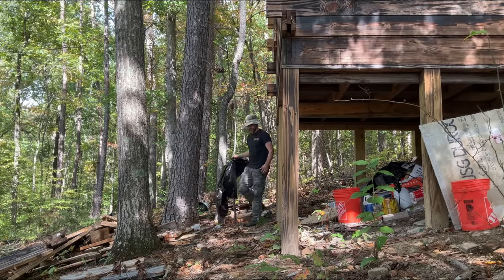One of the comments that I got quite a bit during this build was, why did you leave the OSB exposed to the elements? I guess I really wasn't that concerned since the OSB was flush with the 2x8s and I didn't really think the rain would penetrate it. Almost 2 years later and there's really no signs of the OSB flaking or degrading at all. My plan was to always put a trim piece over top of the OSB so water would never be an issue, and that's what I'm about to do here.